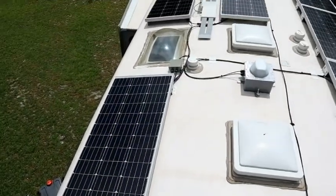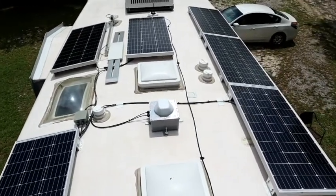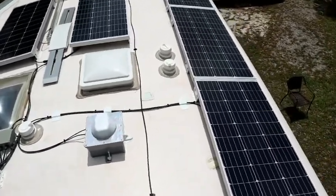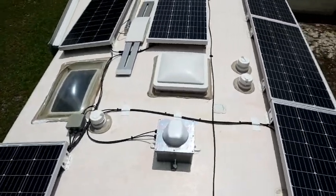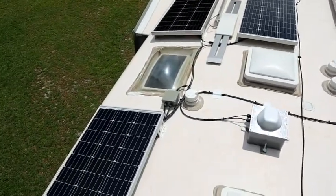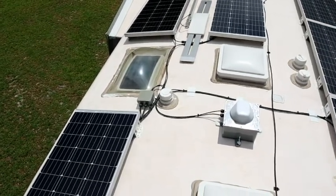Here is the final product with all of our solar panels attached and wires neatened up. We ended up grabbing two more panels, so we have a total of 600 watts up here on the roof. We neatened up all the cables and attached them with some Eternabond tape strips. We have three panels in series on the right side and three more panels in series on the left, and those combine in parallel to go down to the charge controller. We are done on the roof. On the next episode I'll show you down below in our storage compartment how everything got wired together and how it all works. Eventually we'll add more batteries and more solar and grow into the system. Stay tuned — like and subscribe!